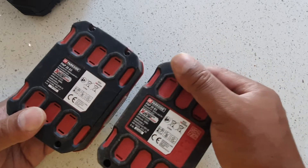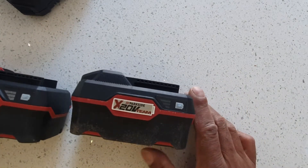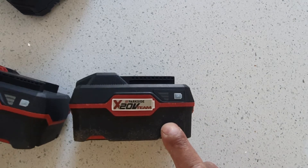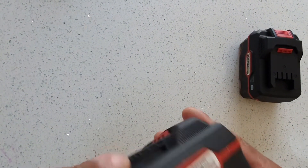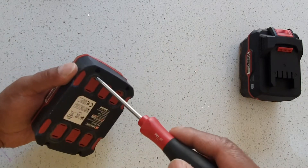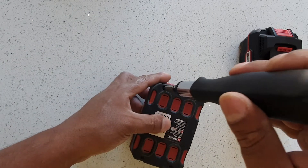The replacement is PAP20B3, and the one I had was the A3. To clean things up, I'm going to take the cover off this one and put the cover from my old one onto the replacement. Let's take it apart and see if it's that easy. There are four screws here — they're Torx screws, T10 — let's remove these.